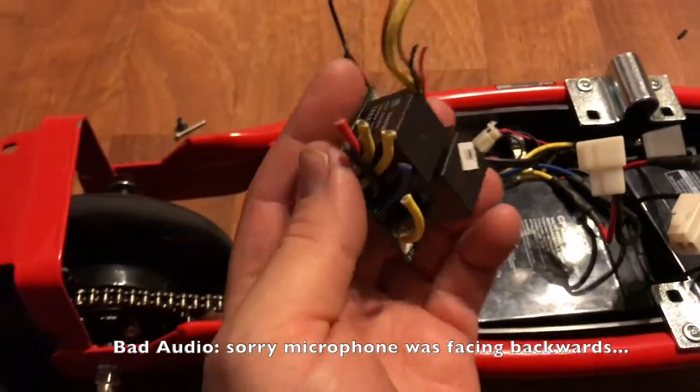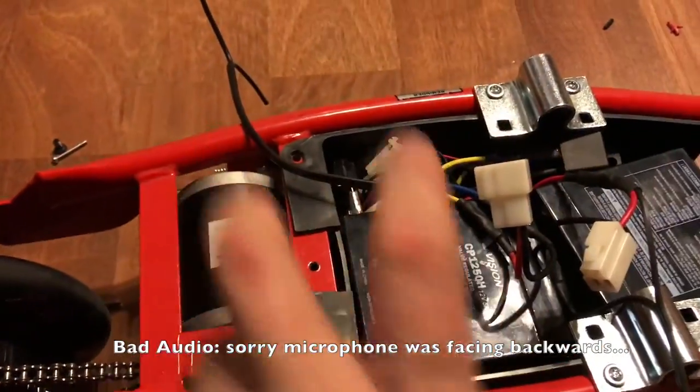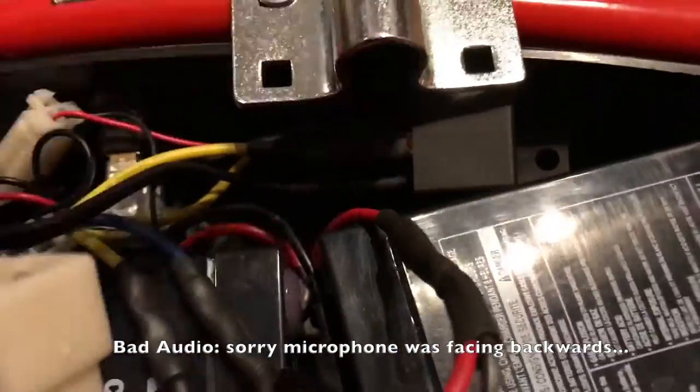Potential issues I'm thinking about: starting from a stop, the thing's going to try and spin and chatter and hop, so I might need to create some sort of half-voltage starting circuit. That's going to involve some resistors and maybe a little bit of circuitry. But for now I'm just going to hook it up so it turns on when I hit the switch and see how that works. I've completely cut all the connectors off the original controller and replaced it with one 30-amp relay.